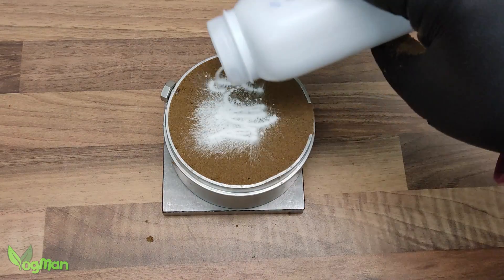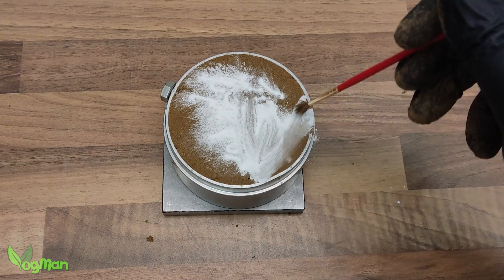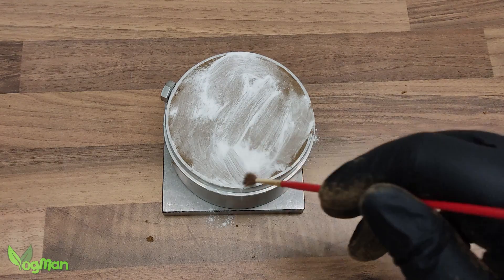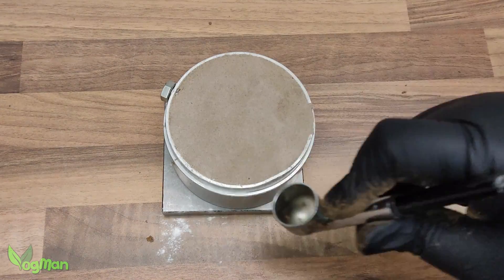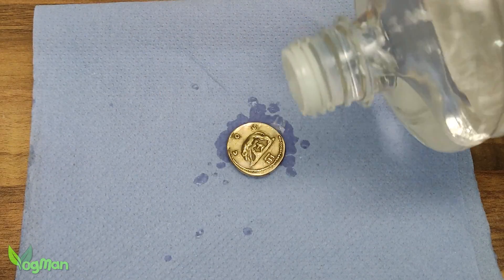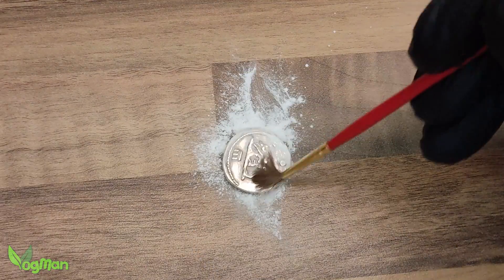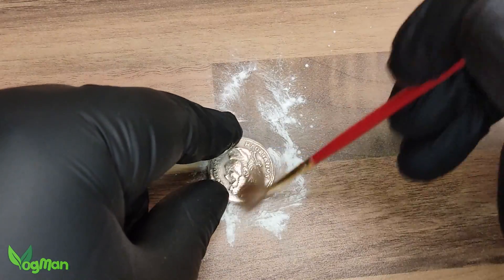Sprinkle on a little baby powder and move it around gently with a small brush. This creates a separation barrier, stopping the sand from sticking to itself. The excess can be blown away with your breath, but I have a cheap airbrush to hand which I'll use instead. It's important that your pattern is clean, so wash it to remove any oils or grease. Personally I also use a little alcohol as well. It's not a bad idea to add baby powder to your pattern as well, and again blow away any excess.